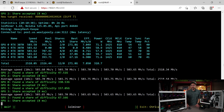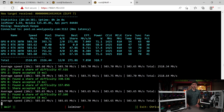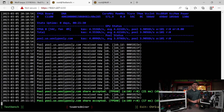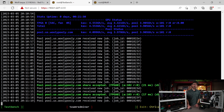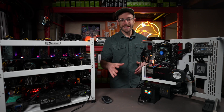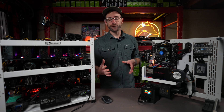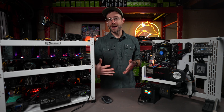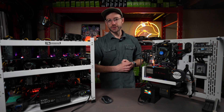Up to five GPUs, and you can see the results on screen. We're coming in at 2.518 gigahash, which is still nowhere close to the FPGA's 4.553 gigahash — a single FPGA running at 130 watts. The five GPUs are pulling 318.7 watts. So right now we're a little over halfway to matching the hash rate but already more than double the wattage compared to the FPGA.